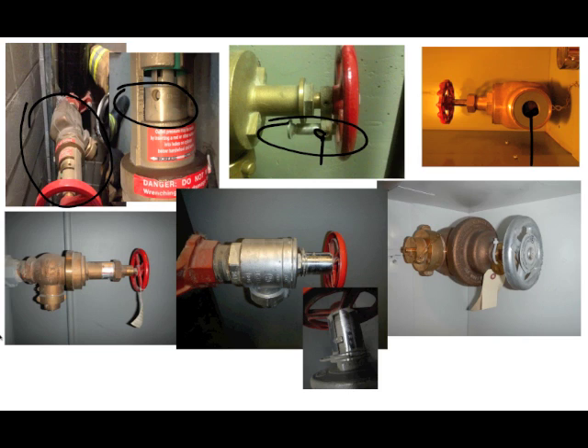The next one — the middle on the bottom — is also designed to be adjusted on the fire ground. If you look at the inset picture, there's a clip right here. If you remove that clip, the valve can be opened all the way. When the clip is in there, it limits how far the valve opens and that's how it restricts the pressure. As soon as we remove that clip, it becomes a normal valve and we should get all the pressure that we need.